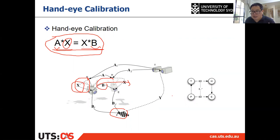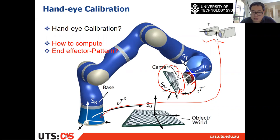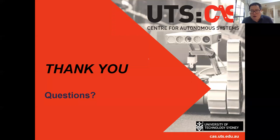So when you move the end effector, you will get similar things to here. Then you can solve both. You can solve the relative pose between the pattern and the end effector. You can also solve the relative pose between the global camera and the robot base. All right, so that is homework. Think about how to formulate your AX equal to XB problem in this case of hand-eye calibration. All right, so that is all for today, and thanks a lot